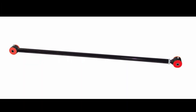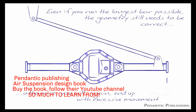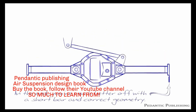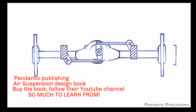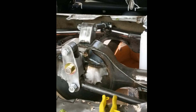Locating the position of the rear end became another research extravaganza. I looked into panhard bars, which I've installed on other cars — they're simple and work relatively well, but as the suspension travels the panhard bar creates an arcing motion that can cause tires to rub wheel wells that had plenty of clearance at ride height. More concerning, at highway speeds going around a corner the arcing motion can cause the back end to throw, creating unpredictability. I started focusing my studies on a watts link instead.